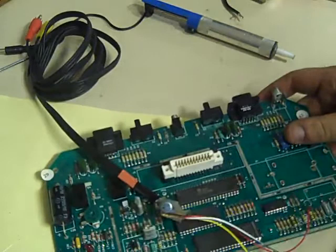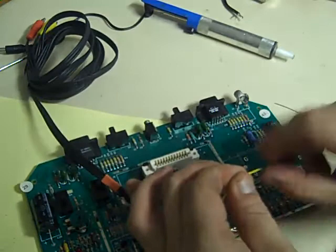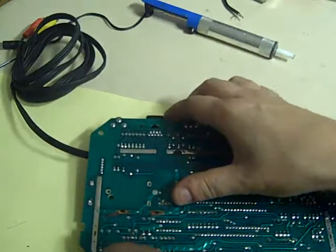That's nice and tight. And we need to use the yellow wire, and that goes to the top of where that R56 we took out went. Let's twist that up a bit better. That slots in there like that. Spin that over. We need to solder that in position.